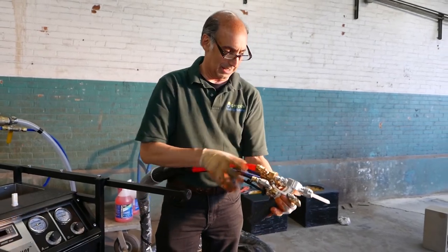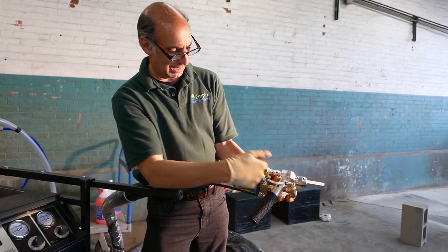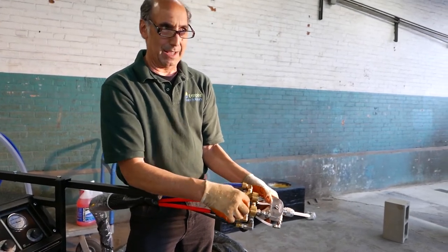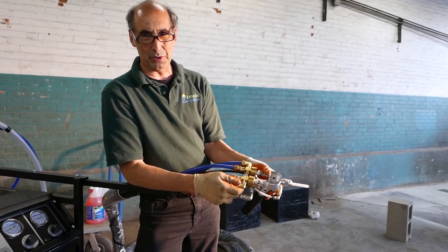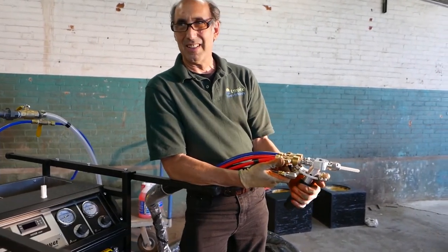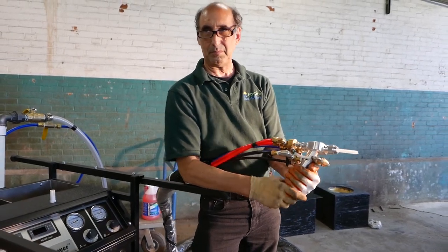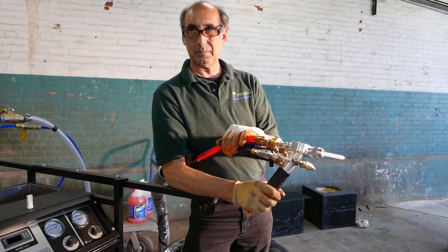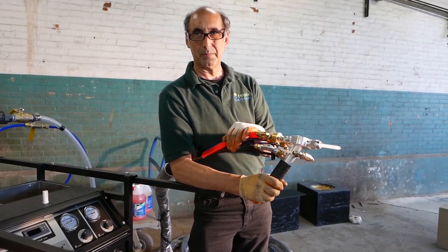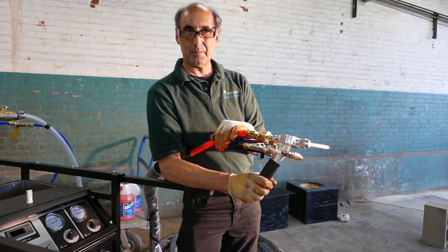The key innovation is the way the acetone and airstream are aimed against the flow, creating extra turbulence and blasting acetone directly at the face of the three-way ball valve. ISO will harden up just like Gorilla Glue, so keeping that ball valve totally clean is critical. This direct solvent flush eliminates most of the problems people have with guns seizing because the ball valve gets seized. Several patents have been filed on what you've seen in this video.